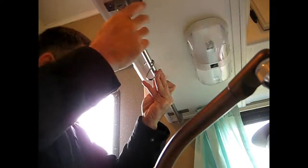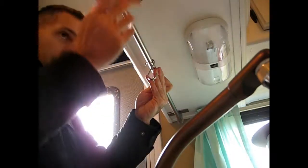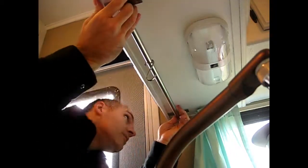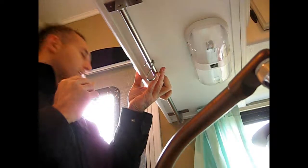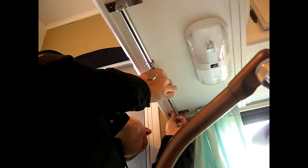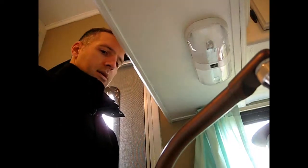The next part is making sure it's even. Depending on how you're hanging it, you might need to use a level. I just have to make sure it's butted up against this piece on both sides and that it's relatively even on both sides. Then I'm just going to draw where my screws will go — make sure you draw it in the center. You're also going to make sure you have enough room wherever you're screwing in up top, so I want to make sure this is thick enough for the screws I'm going to be using.